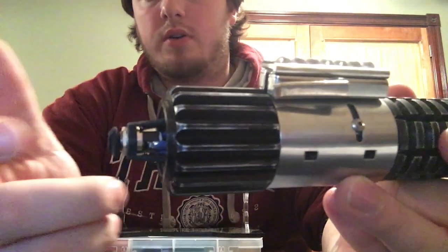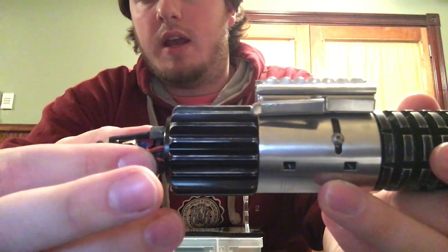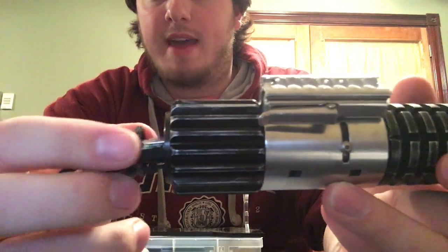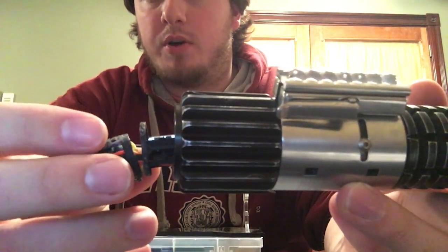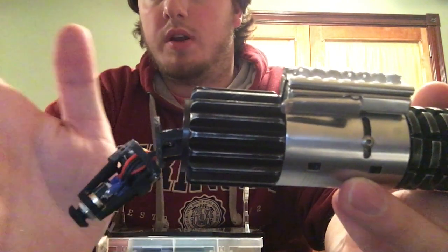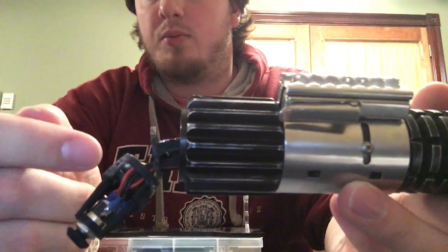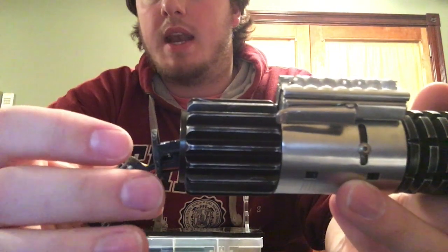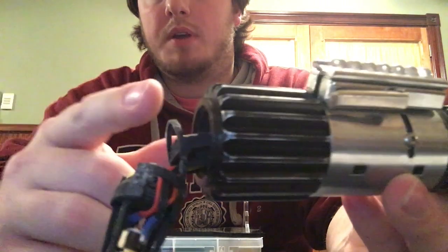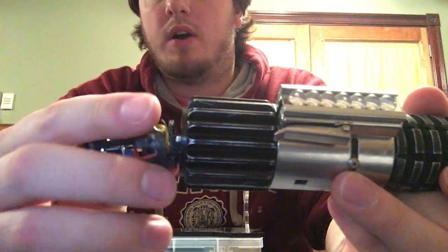Now you have the recharge port and kill key, and if you need access to the SD card, this slides out gently, and there's plenty of slack. This is the 7/8 chassis that moves very freely. This part of the chassis, the speaker holder, does not. It's a little bit stuck, and that's a good thing. You literally just need to take it out that much. It's okay if it's hanging here because I've supported the wires inside and here to make sure nothing gets broken. But be careful, don't start pulling on them and ripping them, because you have SD card access right there. But again, you shouldn't have to do that too often.